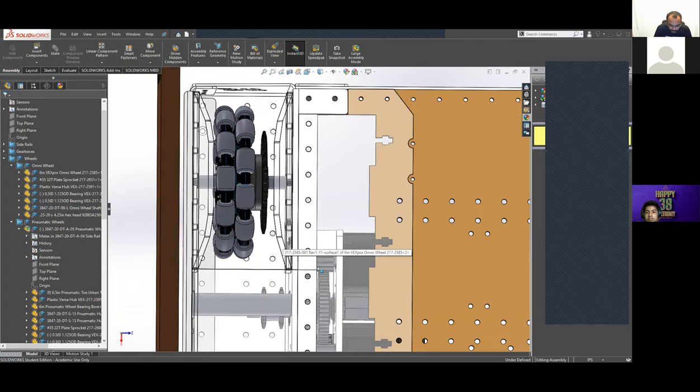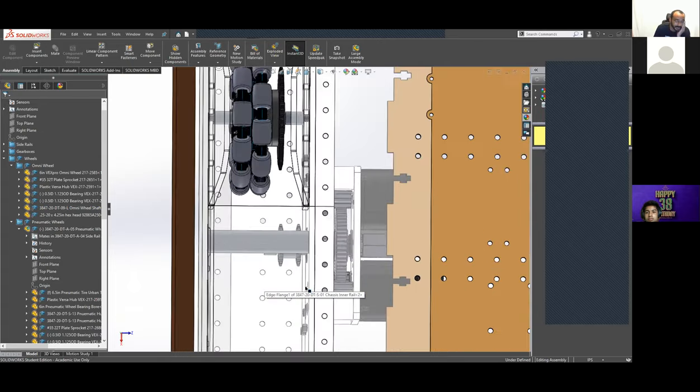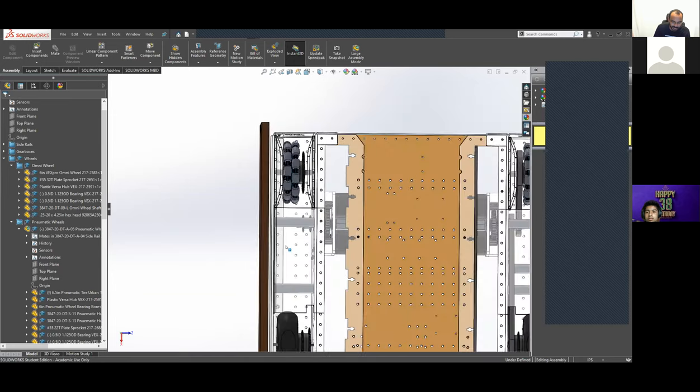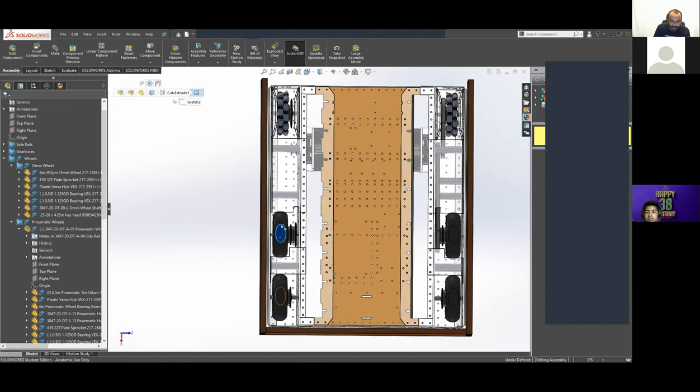So we didn't quite go over what the concept of the drivetrain was, really briefly. Ideally, we were moving to this thing we refer to as a 4+2. You can see that it's offset, that it's not a normal six wheel configuration. Those back four pneumatic tires are all flat. There's no drop or anything back there, and the front Omnis. All six wheels are flat.